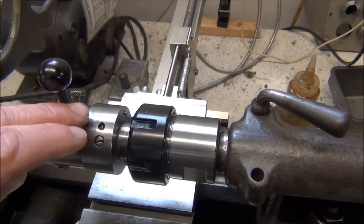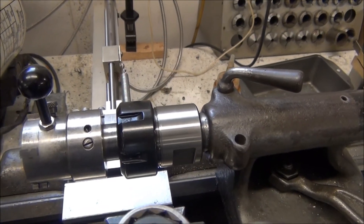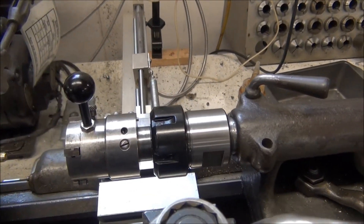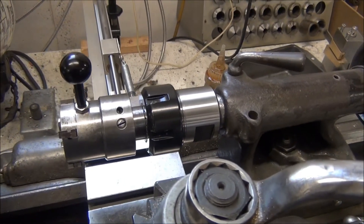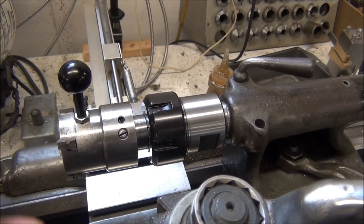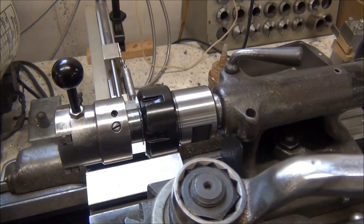There are two setting screws in these holes here — there's a hole in the back side that you can't quite see — and they are just flat head set screws. Those let you adjust the depth of the cut. To make it cut deeper, you loosen this one and tighten the one in the back and it will cut a deeper thread. That's basically a trial-and-error deal the first time you set one of these up. You can either put a screw in here, or if you have some thread gauges you can preset your screws, but most people end up fussing with it a little bit to get it just right and then testing the resulting thread afterwards.